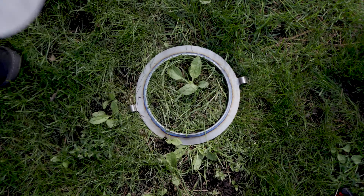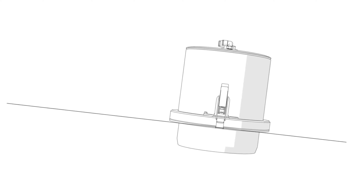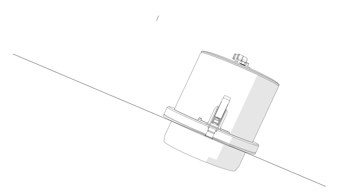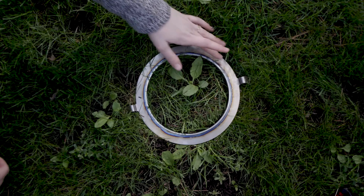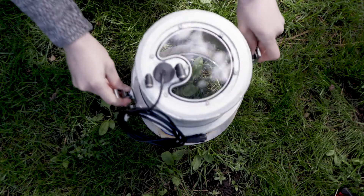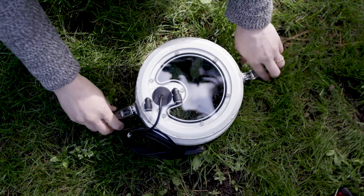Remove the driving plate. For hill installation, install the insertion ring with the tabs that connect the infiltrometer head perpendicular to the slope. This will position the level sensor in the middle of the slope. Clear all grass and debris from the lip of the insertion ring and clamp the infiltrometer head onto the insertion ring to form a seal.